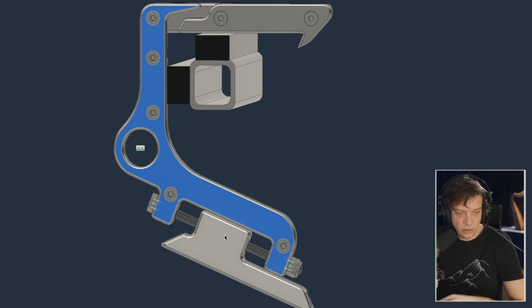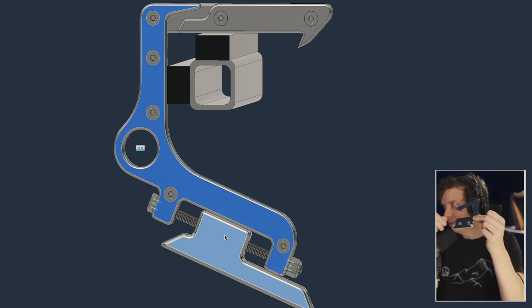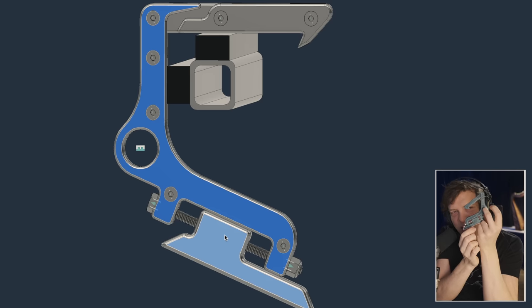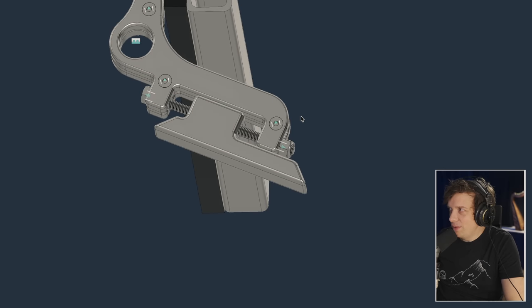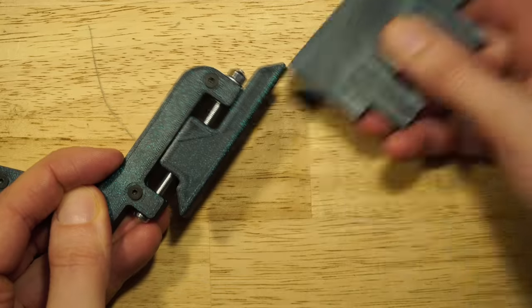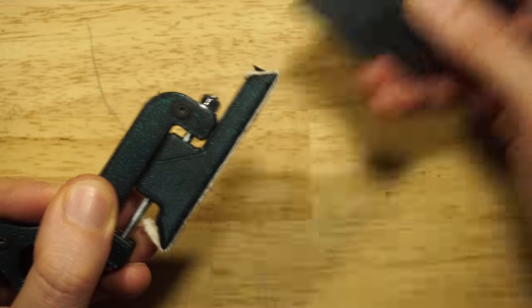There's no spring loading, so it's only falling by its own weight onto a foam pad. So when this reader returns to its original position, it will not bang into anything. It will just slowly, softly put itself to bed, quietly. The other way we have reduced noise is the interaction between the programming wheel and the readers. So let's listen again to how the readers are sounding without padding. And then we're adding the padding underneath, and then it sounds like this.